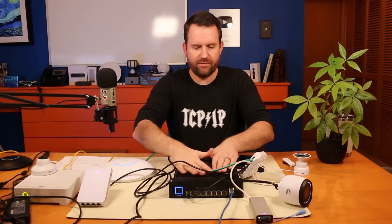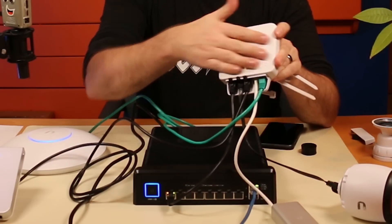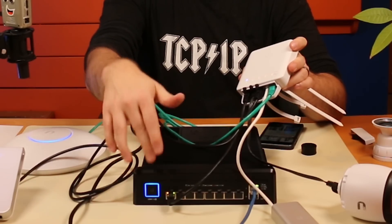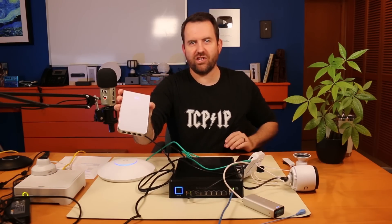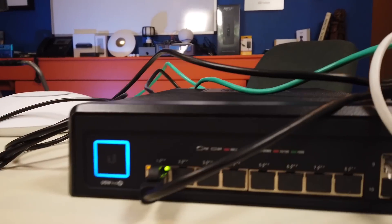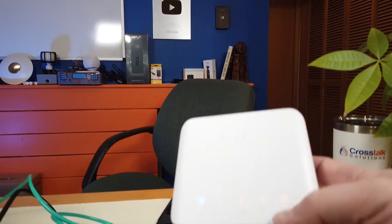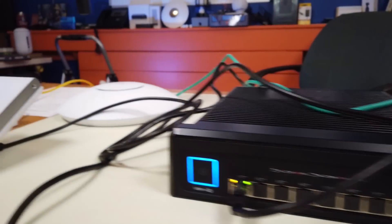I checked UniFi — there's nothing special about this switch there other than it shows PoE++ capability. To prove a point, I have one cable coming out of the USW Industrial going into the USW Flex, and with that one output I'm powering the Flex, a G4 Pro camera, a CloudKey Gen 2, an in-wall HD access point, and a UAP HD access point — all powered on and working just fine. When I was powering this with 802.3 AT, I'd put like three devices in and the third would start rebooting repeatedly because there wasn't enough power. So that is one port off the Industrial powering all of those devices perfectly.